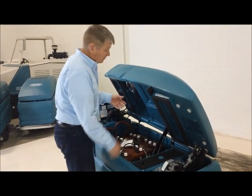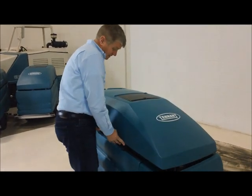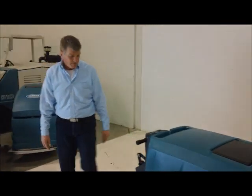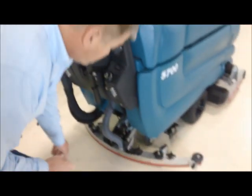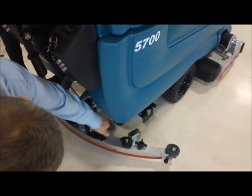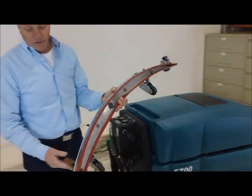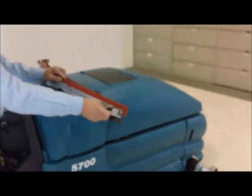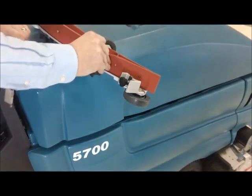When you're ready to scrub, you put the cover down to seal the tanks together. Coming around the back of the machine, take a look at the controls and the squeegee. The squeegee on this machine is easily removed — it's just held on with two knobs. It's cast aluminum with a stainless steel band holding everything together. To change the squeegee, all we do is loosen this band and the squeegee comes right off.